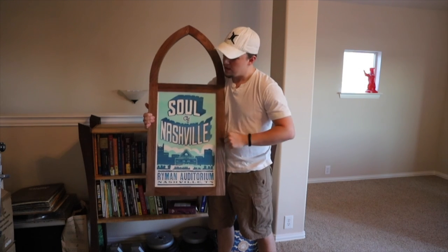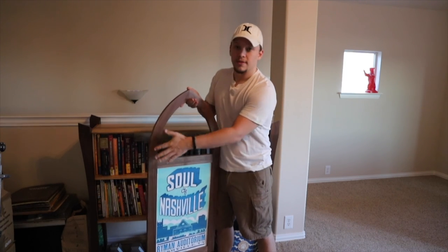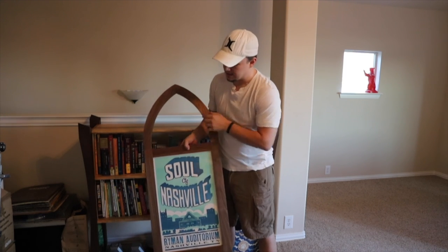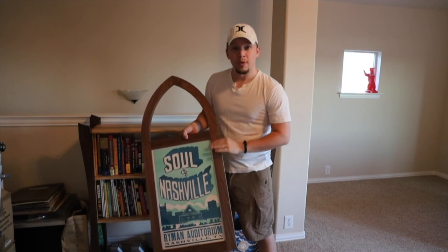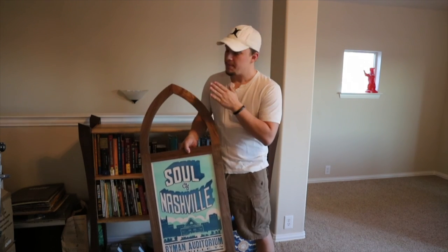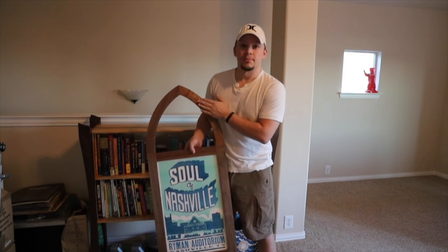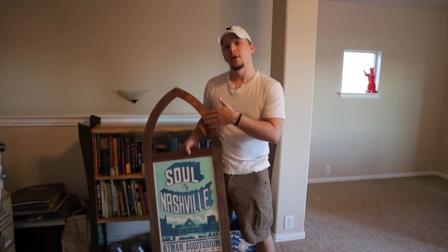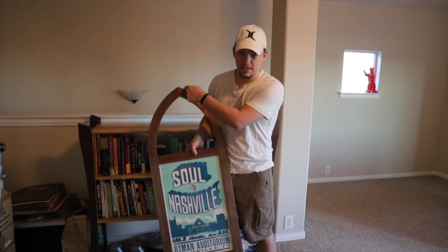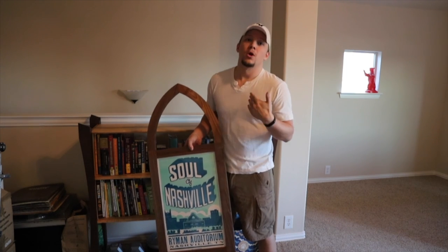The video's got a lot of great info. There's the process of how I made the arch, the template I used, and setting up the strings to draw it all out. The finish is captured this time. I also use pocket hole joinery and dominoes — you can do either. I also covered how to make a template to use with your router so you can perfectly replicate the arch, ensure it's symmetrical, and if you want to make more than one, use that to increase accuracy and repeatability so two or three of these all look the same.